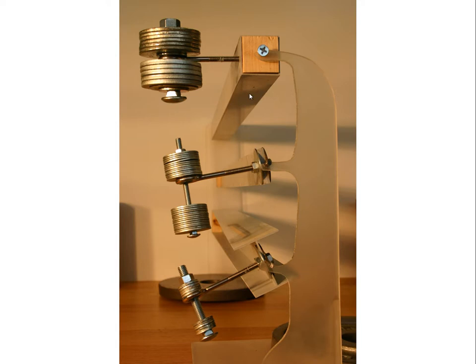And in spite of that, we see no visible deformation in that square tube. The smallest offset force has been put on the I section. And you'll notice that there's a very substantial amount of torsional deformation in this I section. And then somewhere in between, these slabs all glued together has an intermediate force and some intermediate amount of deformation. But this is powerful and profound experimental verification of the fact that an I section or a wide flange section is the worst section you can possibly have for resisting torsion. It works great as a beam under vertical forces, or forces that are basically parallel to the web member in the beam, but they're really, really not good for torsion.